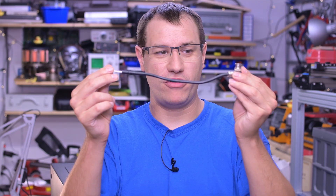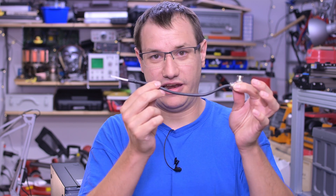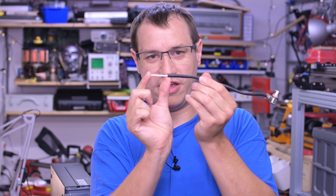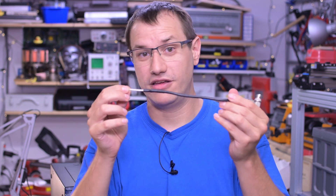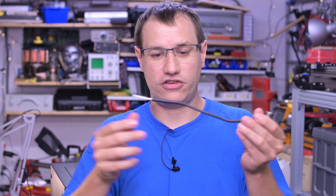Now let's talk about building homemade Wi-Fi antennas. The simplest form is a monopole antenna: a BNC connector, a piece of cable with insulation, and a final uninsulated piece of cable. The insulated section doesn't transmit — only the uninsulated part does — and that piece must be a specific length according to the frequency you're using. For 2.4 GHz Wi-Fi I use 30 millimeters. You can find exact measurements online by searching for DIY monopole antenna for your specific use case and cable type. This monopole is essentially what's used in most Wi-Fi routers.